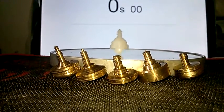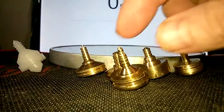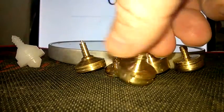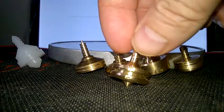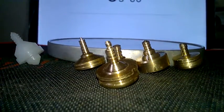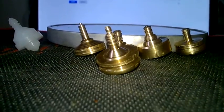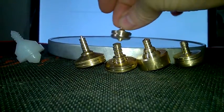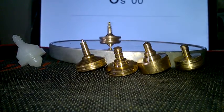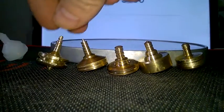Then I went to this one — you can see it's all chewed up, big chunks missing out of the metal. I learned from this one what not to do: don't put it back into a bare-metal three-jaw chuck on your lathe because it's going to chew it all up. It does spin but you can see it wobbles all over the place — not good. That was a bit of a learning curve.